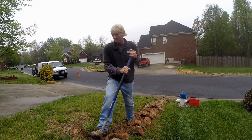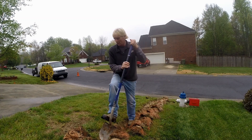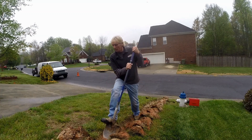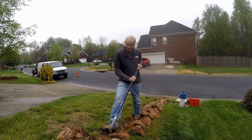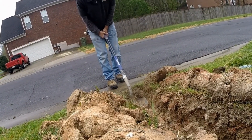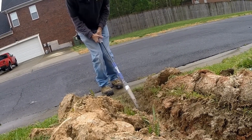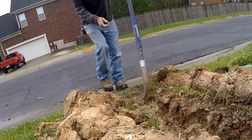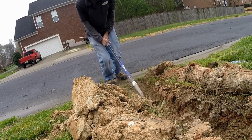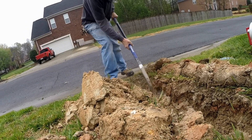Now I'm going back through the trench to make it a little bit deeper — it's really simple to do. Next we're going to scrape the bottom of the trench, and I'll show you how we do that so you'll be at the perfect depth to install your pipe. Working backwards, we go back through the trench and clean the bottom — just use your body weight, push it against you, shove it through, lift up your shovel, and dump out the soil. This makes a very clean trench and you'll be at the right depth to install your pipe.